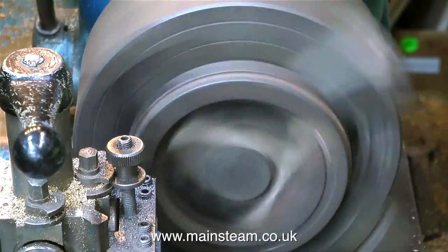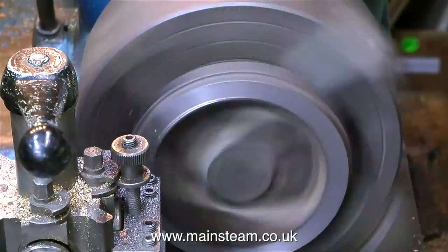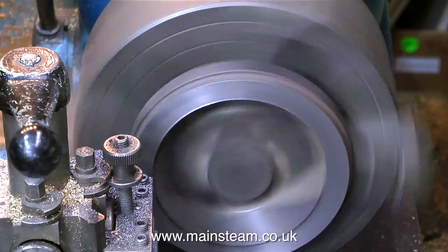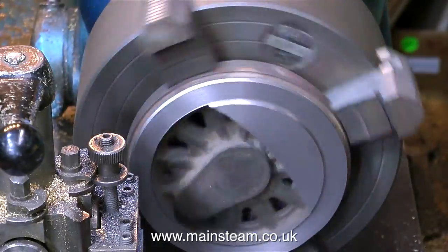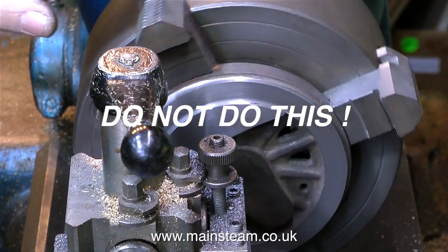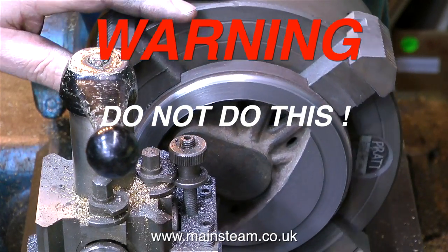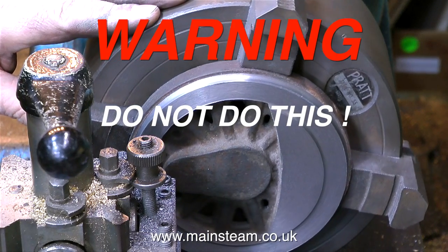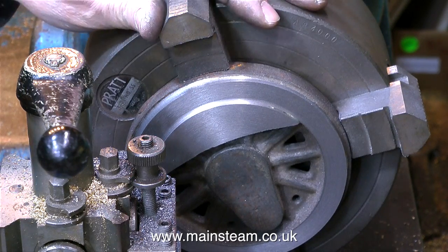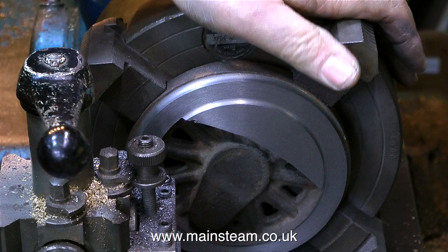Once I get the wheel running true I'm just checking how much material to remove because I don't want it to be too small. I'm going to make this wheel about three quarters of an inch from front to back, which is probably too big for five-inch gauge, but as I'm making what is effectively a model steam engine unicycle it really doesn't matter — the principle is the same. This particular wheel has the balance weight cast in. On some model steam locomotives the balance weights are two plates that are riveted through the spokes and filled with lead. With these cast-in weights you have a problem: you cannot machine part of the crankweb, because the tool will hit the balance weight and make a thorough mess of it.